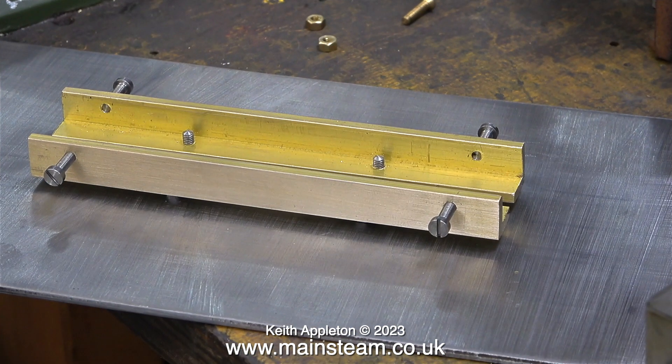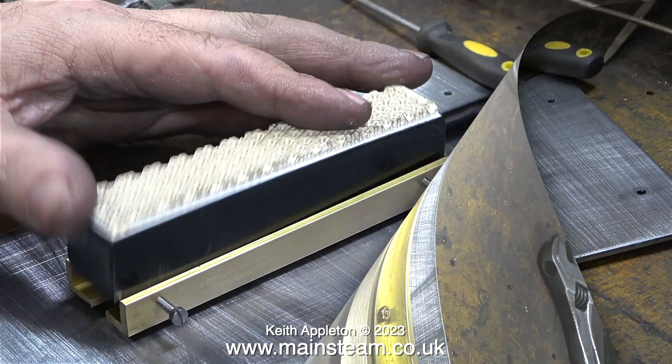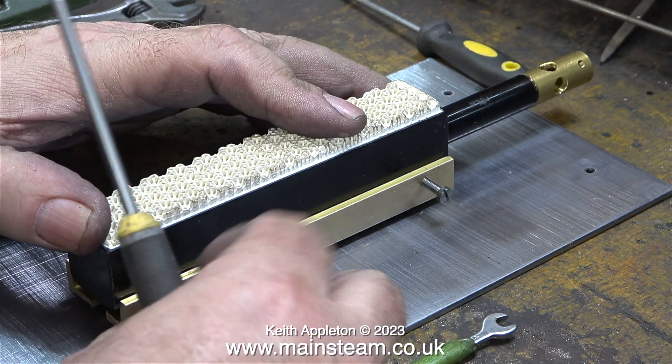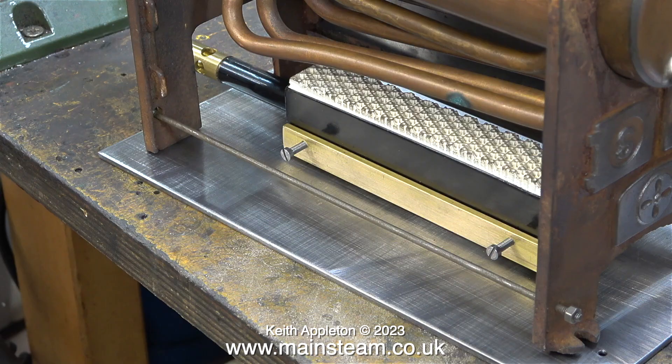This clip should give you the general idea. The original plan was to shorten the machine screws so that they were level with the brass and then sit the burner in position, but as it turns out I had a better idea. It seemed pointless to have threaded the pieces of brass angle, so I drilled the holes clear in size for 5BA. Once I fitted four 5BA nuts to secure the brass angle to the machine screws, everything looked okay until I fitted the burner. This burner is very rounded — the last burner like this that I used was perfectly square. It's not a massive problem. Don't forget I'm using the smaller pieces of brass angle.